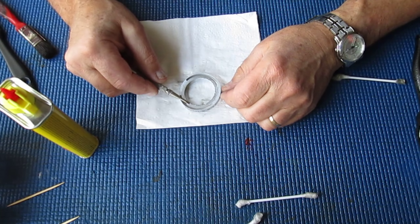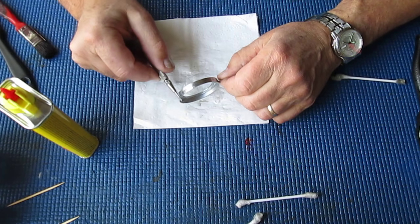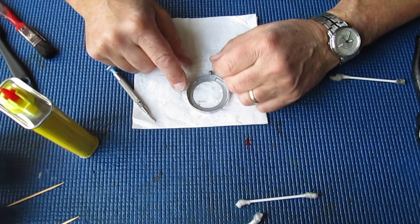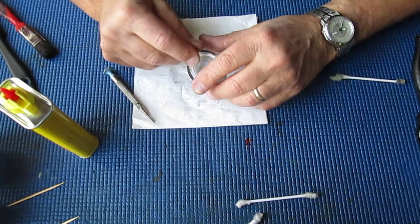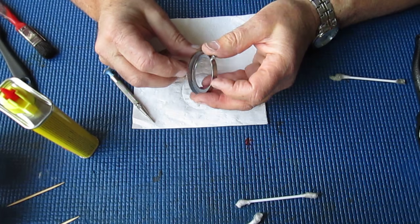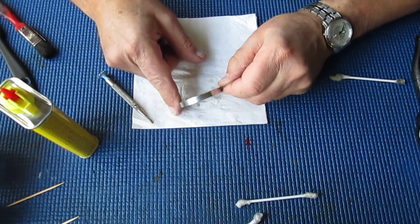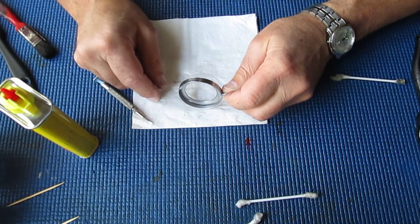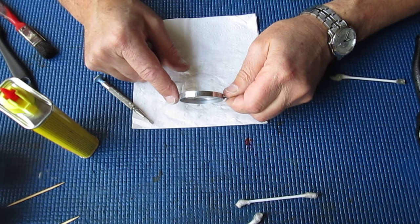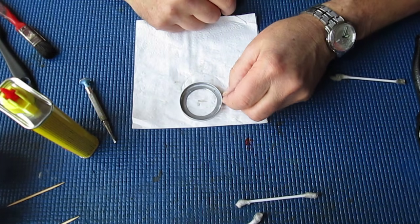Now it probably means corrosion's got underneath it, but you will find with the type 010 that often you'll see very poor chroming on this focus scale ring. It's just typical for the model. It's something that gets a fair bit of handling. Your fingers will be on that as you adjust the focus, and the acid in your perspiration will etch into it. And if it's a poor chrome job, that's exactly what happens. Because this camera's seen so little use, the chrome's in very good condition. It's quite common to see that very poor indeed. Right, so that piece is done.